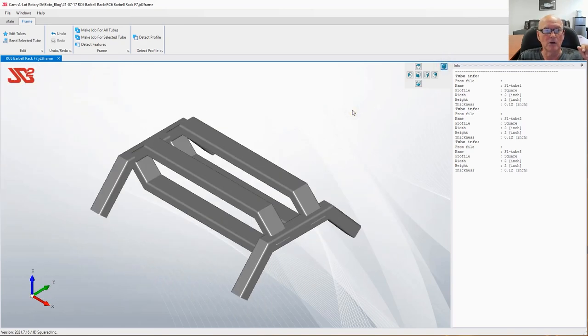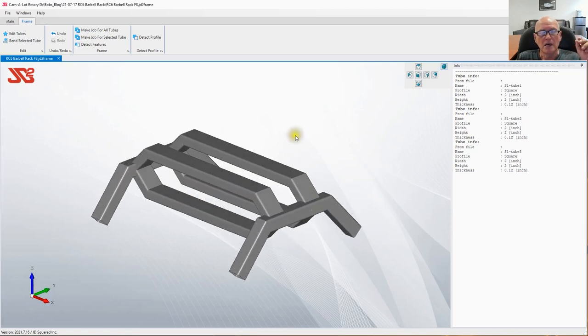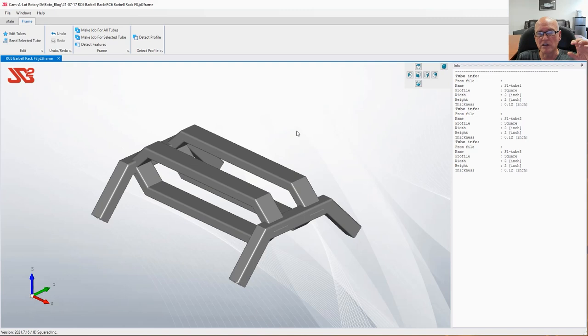All right, let's go ahead and knock holes through this stuff. What I plan on doing is punching holes slightly larger than 2 inches. I'm guessing maybe 2 1/16 of an inch. Now, of course, Camelot works in metric too. So if you're looking at this overseas, or you're thinking in metric, all you have to do is change the units. But for this project, we're doing it in inches. So I think I'm going to go with 2 1/16 of an inch OD. My plan is to punch through the top of the bottom tube only right here, and then completely through these top tubes right here.